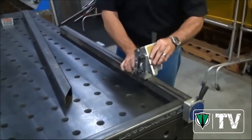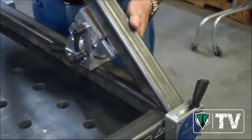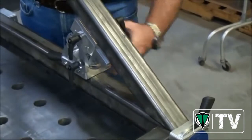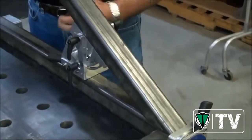So I'm going to bring in my adjustable angle, I'm going to set my piece of steel on it, bring it right up to the point where it touches that magnet, and that's going to be my guide. At this point, just bring the adjustable angle back until the seams line up beautifully. That looks about right. Go ahead and tighten that down and turn the magnets on.